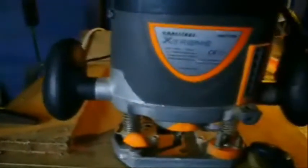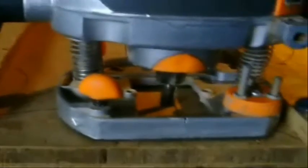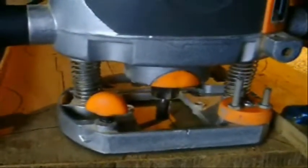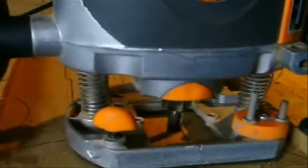It's a very simple method. As you can see, I turn the blade sidewards, so the widest part of the cutter is touching the line. I'm just inside of the line on the neck pocket on either side. In the middle is the middle line — wouldn't worry about that. It's just inside of the line on the other side so it can be nice and parallel. I'll probably go down in 5mm increments so as not to overload the cutter and burn the wood too much.